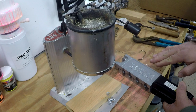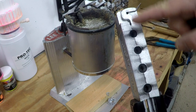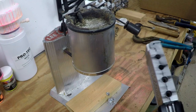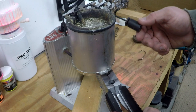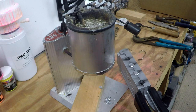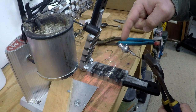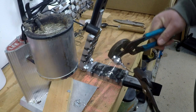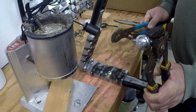Here's another tip: when you close your mold on your hooks make sure that your mold closes properly. That center seam right there should fit very flush. If it doesn't, your mold's not closed all the way and when you pour, lead's going to leak out everywhere. Now the easy part — it only takes a second for that lead to set up. When you get your jig out of the mold you have this thing on the end called a sprue. You need to take another pair of pliers and break that off. Bending it back and forth when it's hot or giving it a little twist will break it off very cleanly, and you can see we have a nice clean jig there.